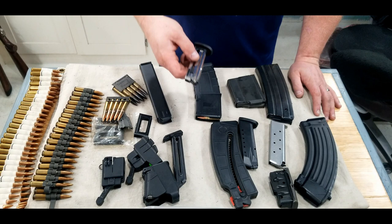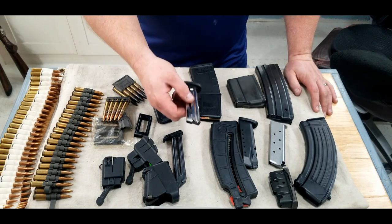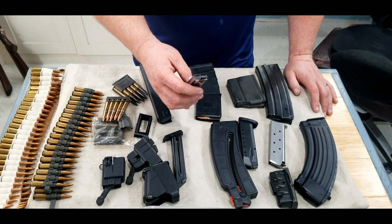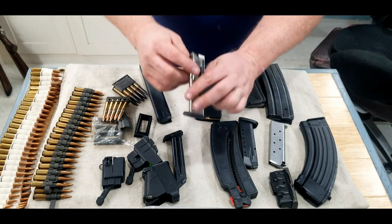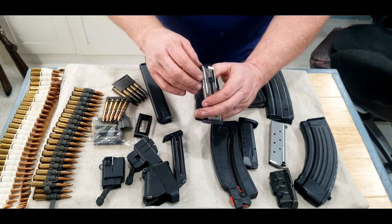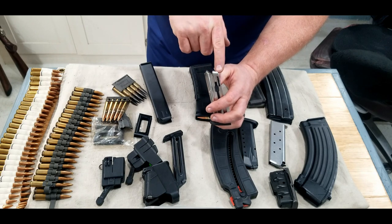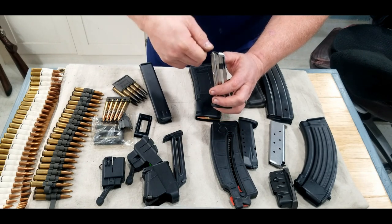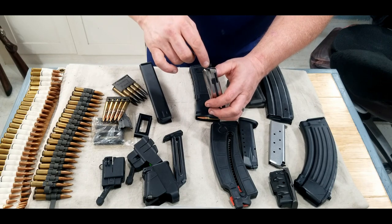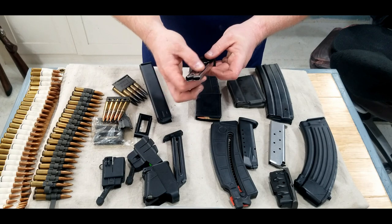Your rimfire cartridges are typically small in diameter. The brass is really thin, and it dents easily. And because these have to, again, be fed under the feed lips, and you can actually see this kind of cutout area where the rim has to fit under here, and then it's captured on the back. If you were to simply push the shells down with the shell above it, you'd risk denting the thin, thin brass on those tiny little cartridges. So again, that's what that's for.